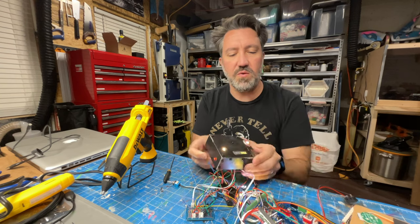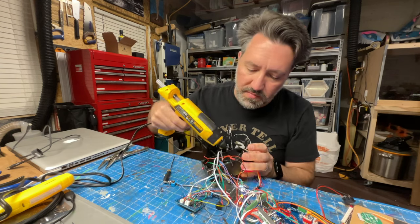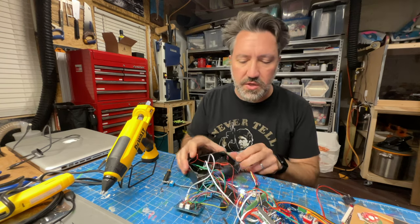This raises a good point about what to do when things don't fit: needle files. These are incredibly useful. All I'm doing is scraping away some paint on the inside edges that was causing a fitment issue. This was printed to very tight tolerances — when I say tolerances, we really did print to the tolerances. It's a snug fit. You can always file it down — a huge gap would be harder to accommodate. There we go, much better. That looks pretty good.